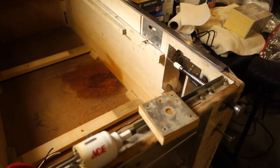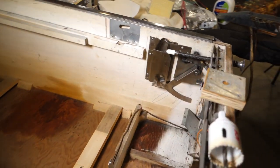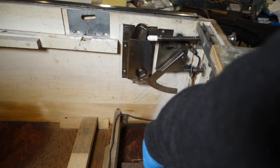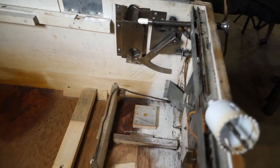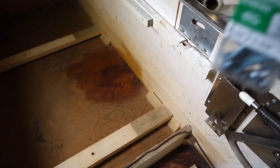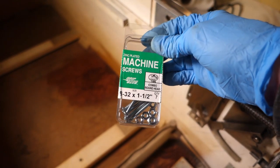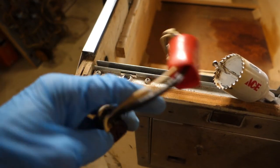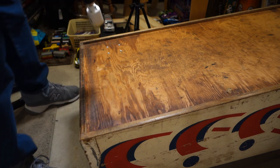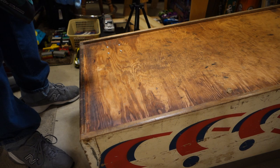That's about average — some games I have a slightly larger diameter hole to reach underneath and flip the switch, some a little smaller. I'm going to put it back in this corner; technically it doesn't really matter but I want to keep it consistent with my other games. I picked up some 8-32 by inch-and-a-half screws — was going to use carriage bolts but couldn't find any quickly so this will work. Here's the switch off the System 11 — we won't need the connector. I've got the wooden block bolted in with a tiny pilot hole drilled through for the center, and here we go.